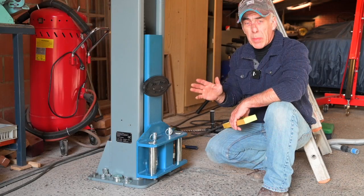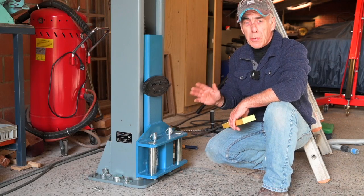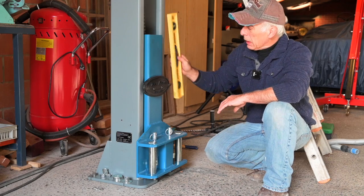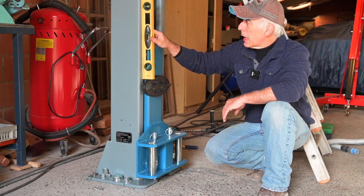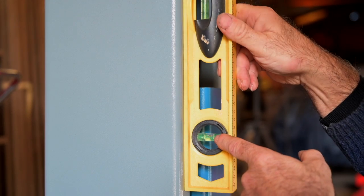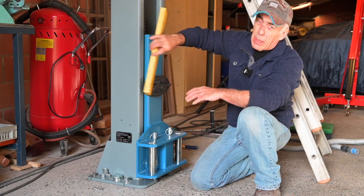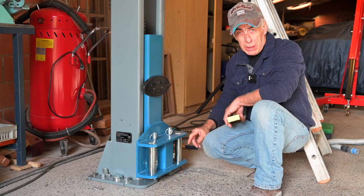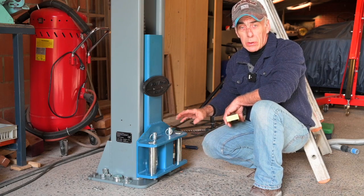It's of extreme importance that the pillars are absolutely upright in all directions. You will need a level meter to do that and measure the level in all directions. If the pillar is not level, you may have to use a couple of shims underneath the base plate of the pillar before you tighten down the nuts and bolts.